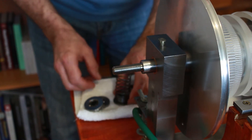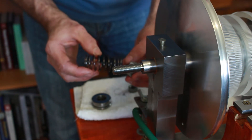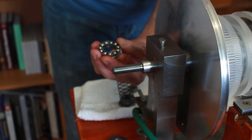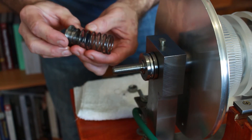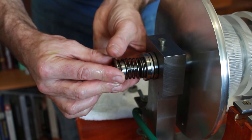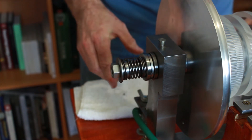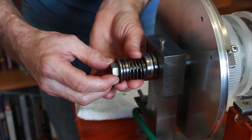Here at the back, the only thing left to do is to put the thrust bearings and the spring for pumping action. The thrust bearings go first - a little bit worn in there - goes on the spindle. And I've got the spring, which goes next, and this little adapter here. The only thing left is to put the nut to lock everything together. That spring should work fine - I can always tighten the tension in there.